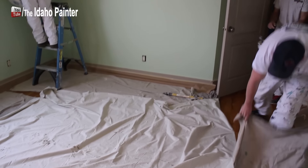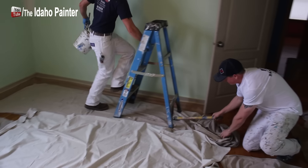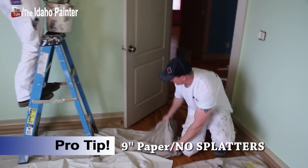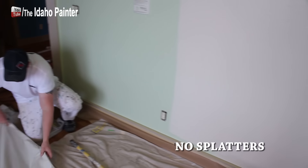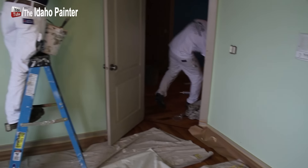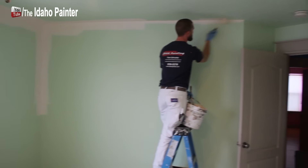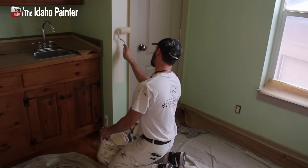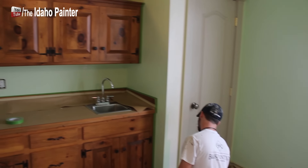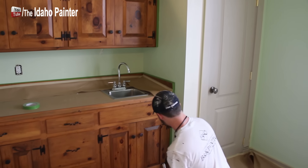It's great just getting all the drop cloths laid out down here. You can see our 9-inch paper is run all around the floors too, so we'll get our drop cloths all the way up to the wall. John's already starting to cut in around the ceiling edges and above door frames and so forth. Zach has already masked this thing up — I don't think it took him more than less than 10 minutes to run all of his 1-inch tape, and he's starting to do his cut-in.